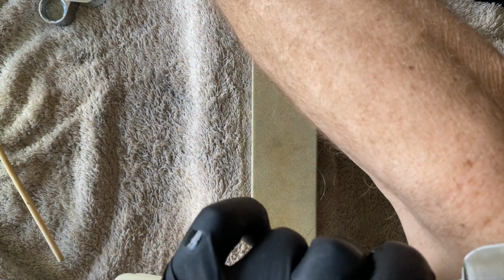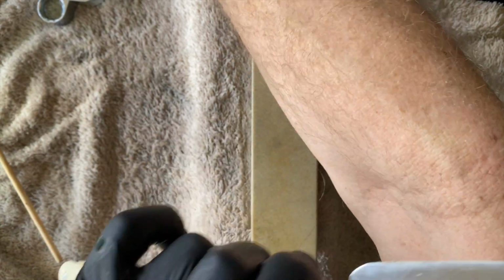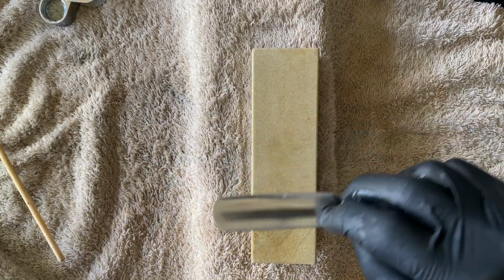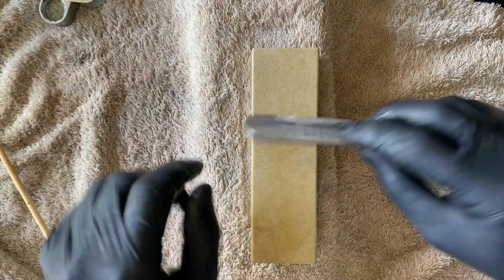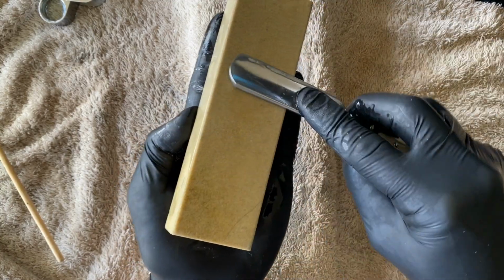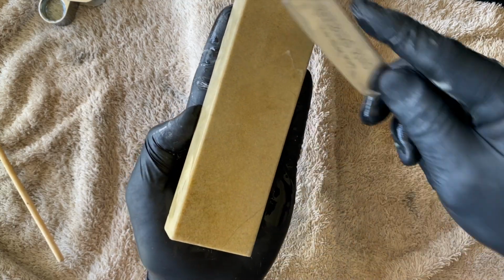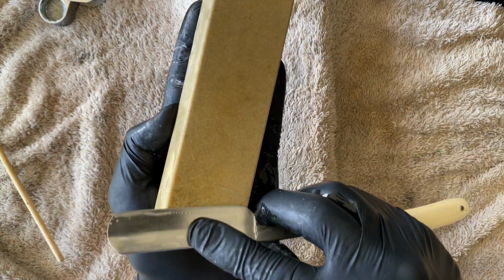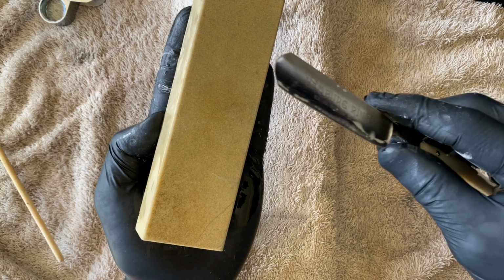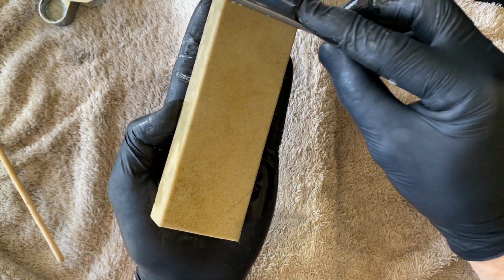It's taking hairs, and I think a lot better than I thought it would. Yeah, no, it's flying. So it is, yeah, no, there we go. I just need to work it. So my statement around if we can maybe get shaving off this, I'm not that convinced. But let's switch hands and see if we can improve the keenness of the edge of a coarse stone. And maybe with this, I think we also need to maybe do spine leading strokes. And I think dressing the stone finer is also going to make a difference. So let's just reduce the weight here as much as I can.